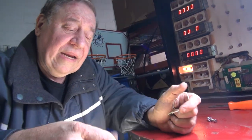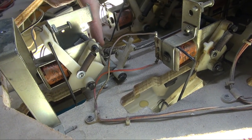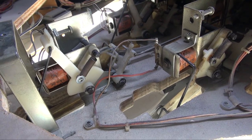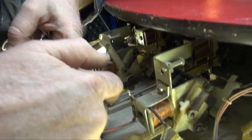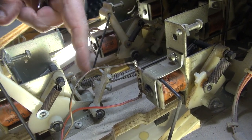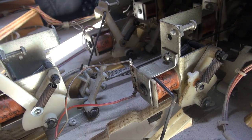So the beauty of this system, and it's an incredibly great system that Williams came up with, is that when the pin swings down, it resets itself, do you see? And just the slightest touch kicks it up. So if somebody hits it, or even if you slid a little baby down the alley, the baby could never get hurt because it would instantly swing up. And when the pin section went back to reset it, this is the reset arm. It's not connected to the pin. So if the pin encounters something on its way down, it will not stay connected. It'll immediately drop. No matter what you do, it'll never, ever connect.